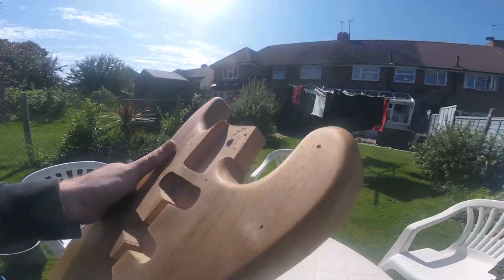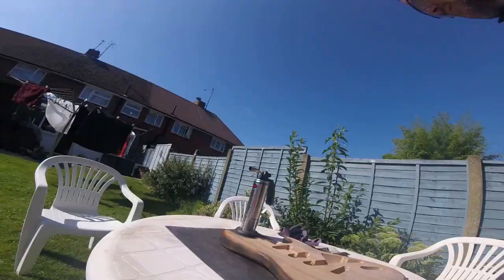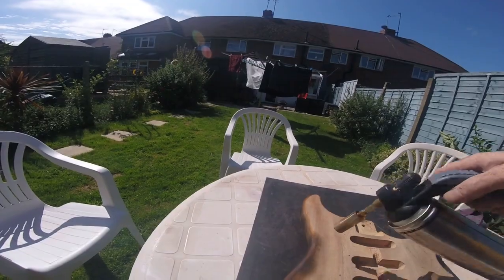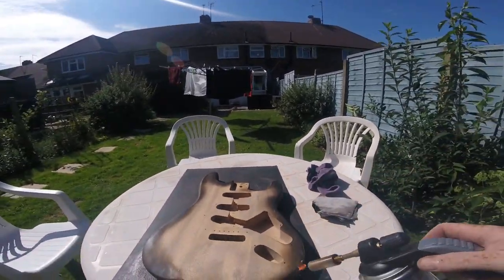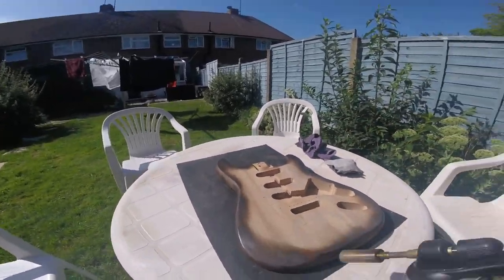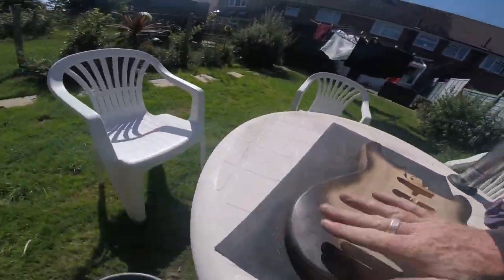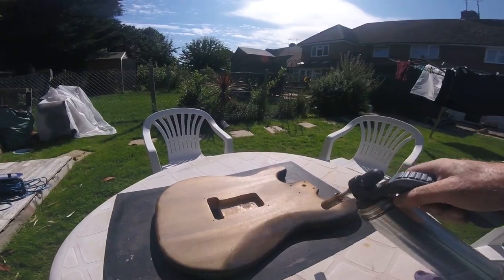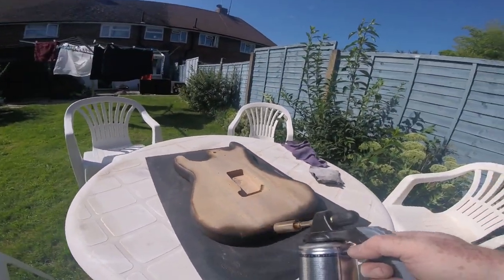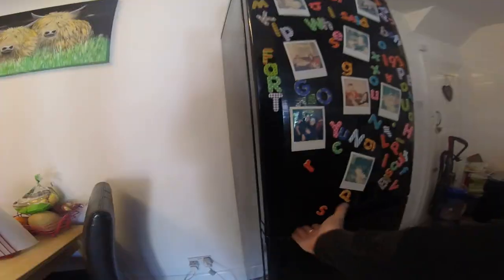I was a little bit worried it might fall apart but it didn't. And because of the effect I'm going for — oh yes, and beer, very important to have the beer — I went straight for it. The idea was to really char it up around the edges, get a good burn on it so it was quite black around the edges, then just bring it in slightly over the face. Keep the blowtorch moving, don't stay in one spot too long as it heats up very quickly. The main fear was where that damage was, whether it was going to split open, but it was okay — the cracks in the wood actually added to the burn effect.